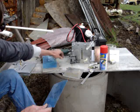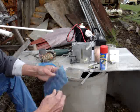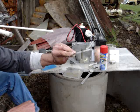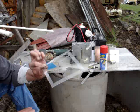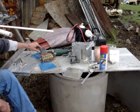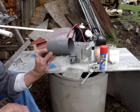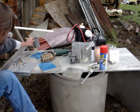A better gasket material that I found is using this 1/32 of an inch plastic material. It's 30 thousandths of an inch thick, plexiglass or Plasti Dip, same way. Excellent gasket material. Also, this automotive rubberized fiber sheet is another very good gasket material. Experiment, try different things.